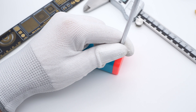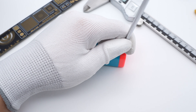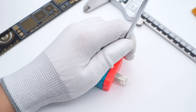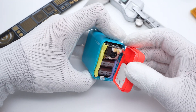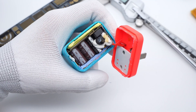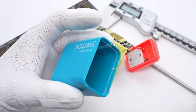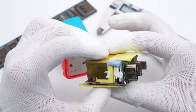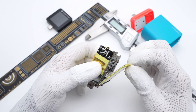Let's take it apart and see how it integrates the HDMI port inside. The red part can be easily removed with a spudger. Then we take out the internal PCBA module. The entire module is wrapped with a heatsink for heat dissipation. The small output PCB is soldered to the main PCB. Let's slowly remove the heatsink and the thermal pad of the PCB.